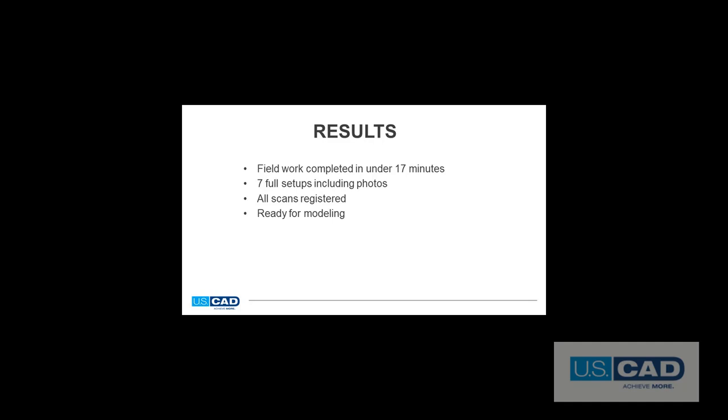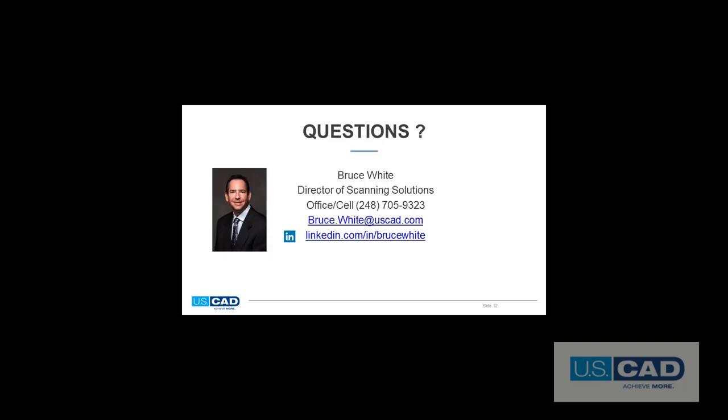In less than 17 minutes, I arrived on site and completely scanned the existing conditions with enough detail for the modelers to create an entire Revit model. Each of the scans were registered automatically by the VIS system. In all of my testing and usage, the RTC360 does a fantastic job of tracking the location of its scans and putting them in the right place, saving hundreds of thousands of hours of office work and registration. Please keep in mind that this is truly an automatic registration, not a pattern recognition algorithm after the fact that requires a bunch of processing and may or may not align on its own. The registration is done real-time in the field and verified in the field. Thank you for your time today, and I hope you enjoyed the video. If you did, please feel free to leave a comment, call or connect on LinkedIn, share or like the video, and subscribe to our channel. Have a great day.